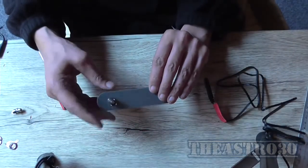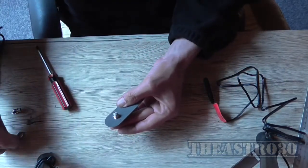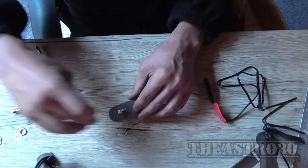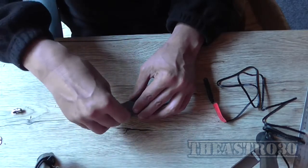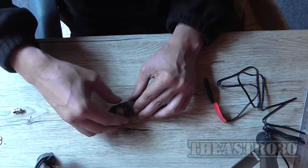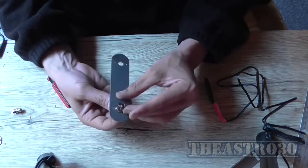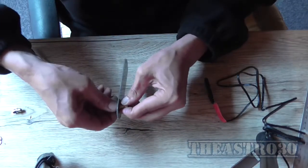That's the inside edge. So I'll start by mounting the BNC. Never did really like these type of BNC sockets because they have the tendency when you drill a hole, unless you do it in metal of course, as soon as you start tightening it up on the outside it just starts turning or strips the hole that it's sitting in. They're very finicky things to work with, and especially working with ABS plastic, it's hard to get these super tight. So, but you do your best as you can.